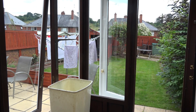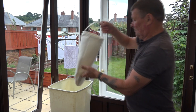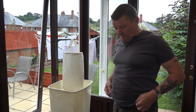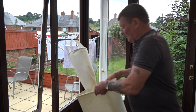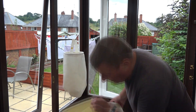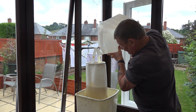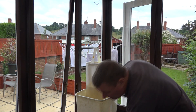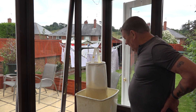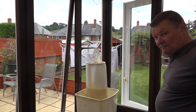For the final bit, we go down to the last bag which is one micron, but if you want to you can actually use a five micron which would still be fine. Now I've got the last one which is a one micron bag — the bags are made of linen by the way — and it may take a little longer for the oil to filter through the last filter as it's so fine, but once it's done that, we're done.